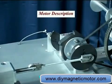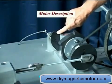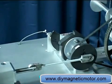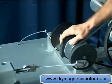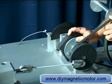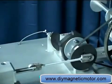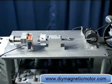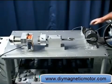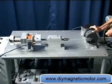The timing count is 155 degrees. It controls when and how long electricity is applied to the coil through each revolution, which is only 43% of the time. Note the coil is activated here and deactivated here. We're using this linkage mechanism to convert the linear motion to rotary. It's good for that, but I feel it's a poor way to utilize the motor's full potential when the magnetic force is at its greatest position.